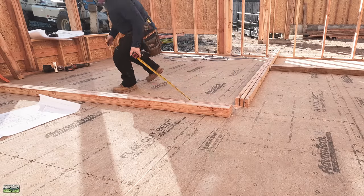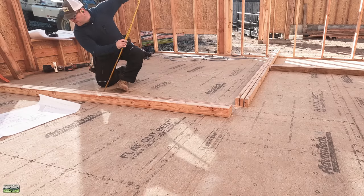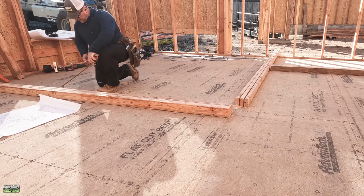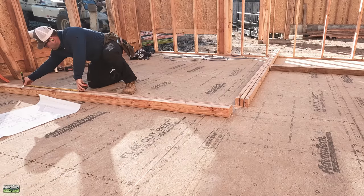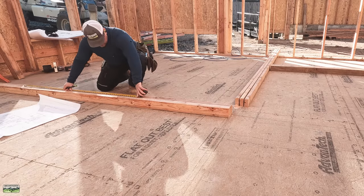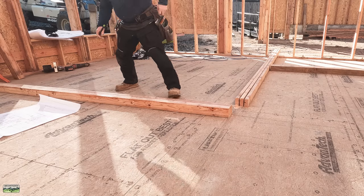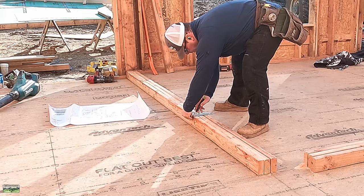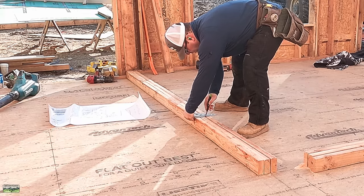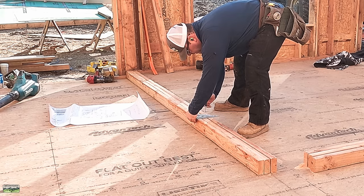12 foot 2. Find the center of your doorway. In this case it's not even a doorway, it's just an opening — I think it's a 4 foot. So I center 2 foot on the mark, mark each end. Now with my square, because I have inch and a half scribes, I can mark king stud and trimmers. If you don't know what those are, I'm going to link above to a basic layout video from this house.